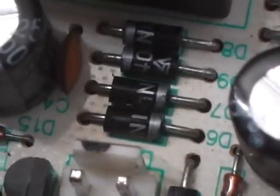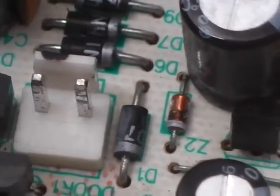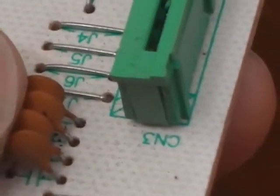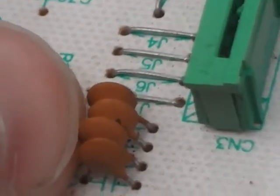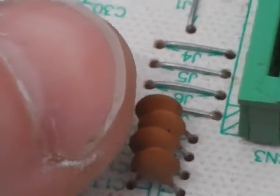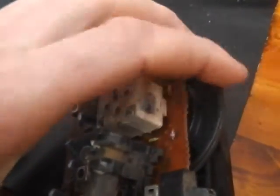There's a black and silver one there and another bunch there — those are power diodes for converting AC to DC, but that's nothing to do with this. You also need a ceramic capacitor — one of those little orange things. The size you need depends on that variable capacitor there, which is hooked to your tuner.